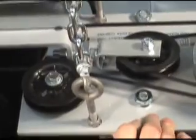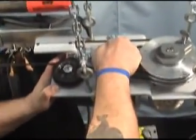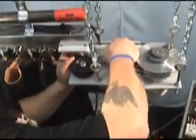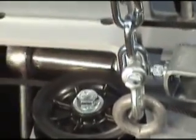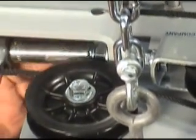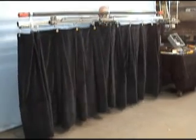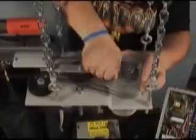Next, add additional tension to the cable with the tension pulley. Operate the curtain manually as you push the tension wheel assembly backward to make sure the pulley is seated properly. Hand tighten the device's nut. Then use a 9/16th deep socket to apply additional tension to the system. Do not over tighten this device — you only need to apply a small amount of additional tension. Lock the device in place with the assembly's lock washer and jam nut. Operate the system manually several times to make sure it is rigged and operating properly. Rotate the drive wheel until the hole in the drive wheel aligns with the driving dog thumb screw and turn the thumb screw clockwise until it is fully seated.